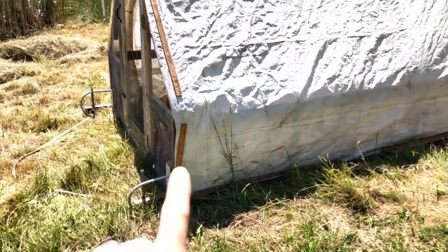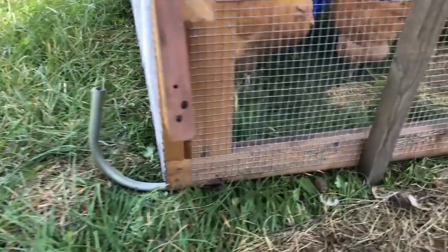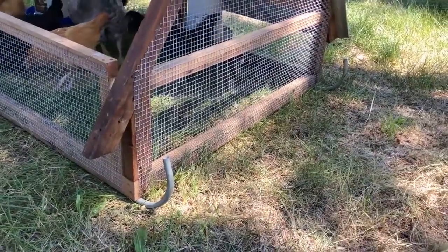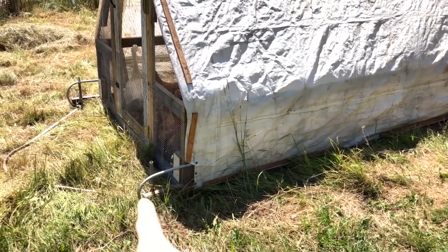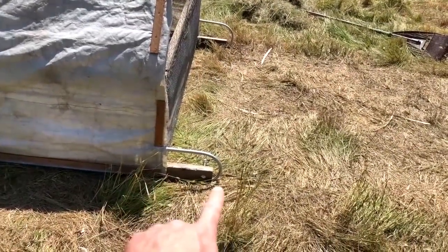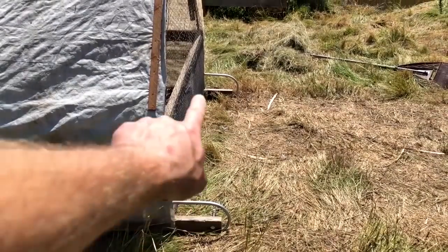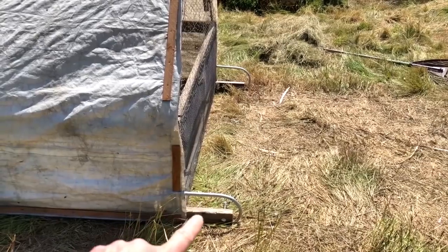I've done different versions of these skids, starting with the A-frame chicken tractor. Those skids are a little shorter. It was kind of the first iteration of that idea to make it slide easier along the ground. After building that though, I realized that I should really lengthen the amount that the conduit comes away from the main base frame, so that when you lift up on one end, it'll pivot further back as if it was on the wheels, and therefore lift this back frame piece a little bit higher off the ground than if the skid was starting to curve up right there.